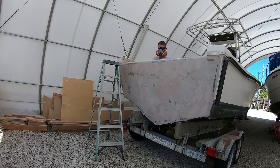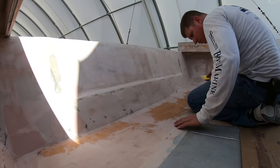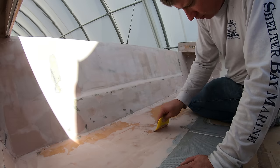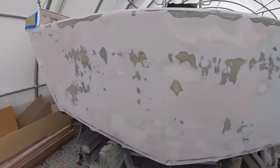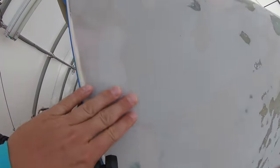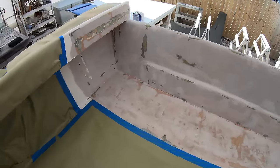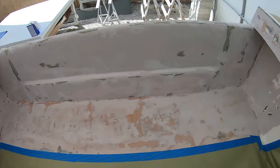Some things just have to be done by hand when it comes to smoothing them out. This process just continues on with the sanding and fairing. Most professional fiberglass people can get it pretty close in just one coat, but that's after years of practice. As an amateur, I just have to do more sanding and more practicing. After lots of applying and sanding, we will eventually get everything smoothed out and all surfaces as flat as we can. It's getting these surfaces down to this level that makes our gel coat come out looking beautiful — this is more of a skilled art form and it takes a lot of trial and error.